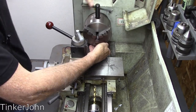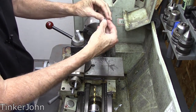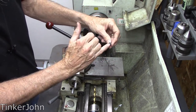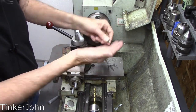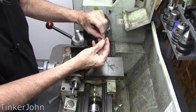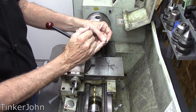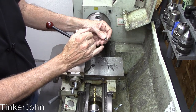Take that out. You've completed the base with one exception — we'll take it over and blacken it with some oil. That's your spark plug base right there: quarter by 32 threads, one-eighth inch hole one way, quarter inch the other way. I use JB Weld — you can use epoxy — but JB Weld will hold the insulator in just fine, and we'll do that in part two.